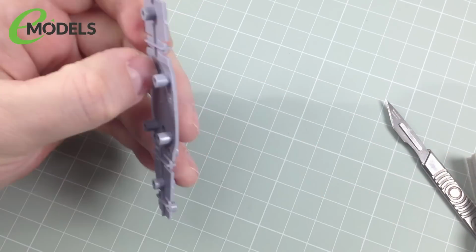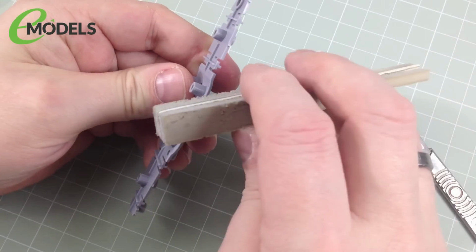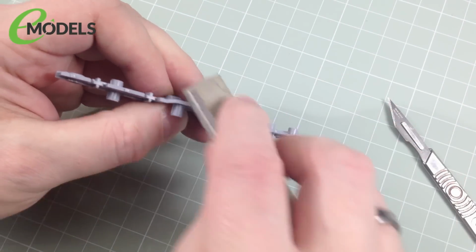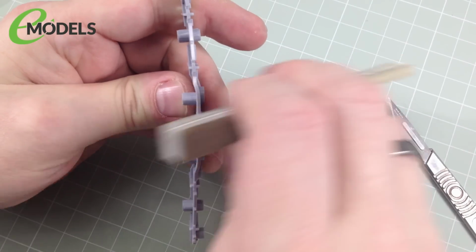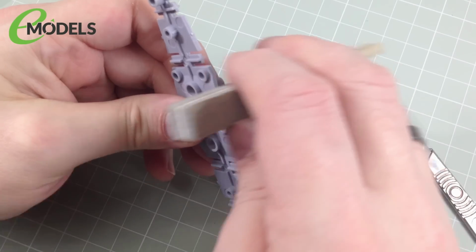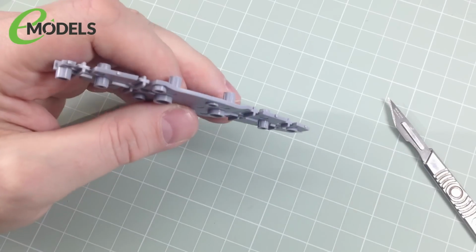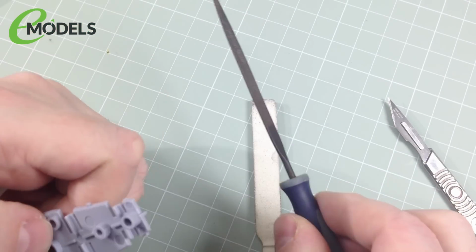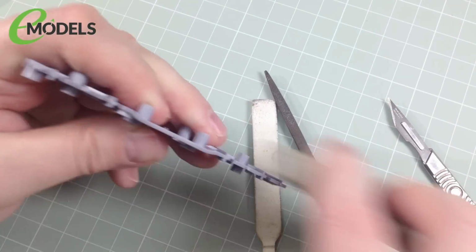So that's that. And then I'm going in with an even smoother stick. This is my sort of finishing sponge. And on this one, because it's very, very smooth, I can just quickly do that. I can go backwards and forwards on this one. I'm not actually sanding anything flat. I'm using no pressure, and I'm just softening all the little scratches that this put in. And then this in turn, remember, softened all the little scratches that that put in. And because it's finer, it's just smoothing everything away.